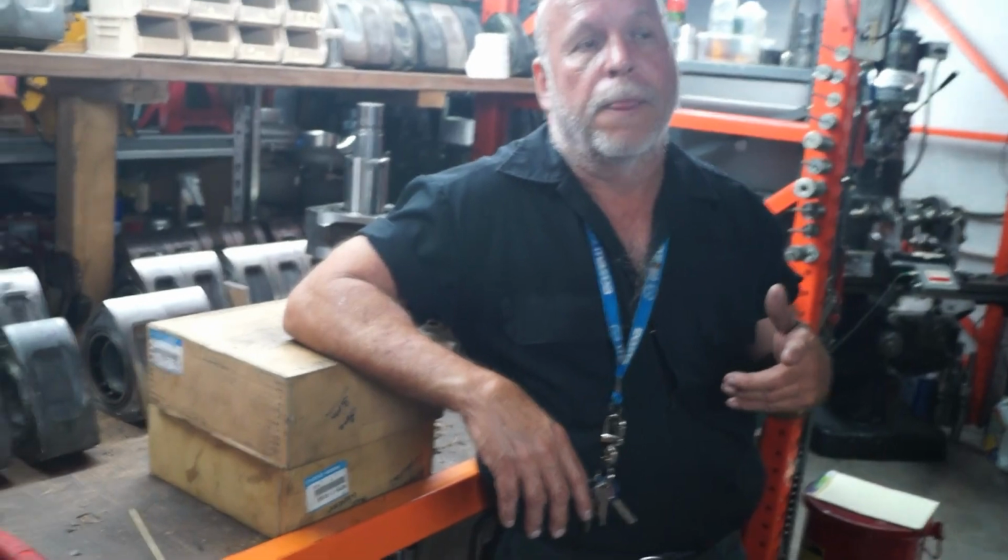the engine. Another thing that happens with a turbo motor that a lot of people know when it happens to them, but they don't consider it as a potentially dangerous and big expense, is that if you break an apex seal or shatter it, the majority of the time it'll break into several pieces, not just two, and by sheer luck happen to stay there. If a piece breaks, it's going to go right out the exhaust port and straight into the turbocharger exhaust impeller. So not only are you now looking at rebuilding an engine or half of an engine, you're also looking at a new turbocharger.